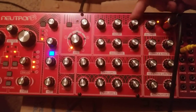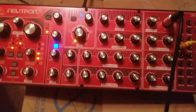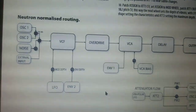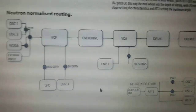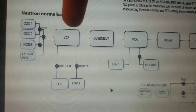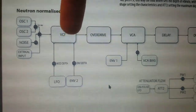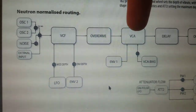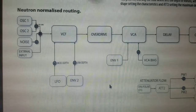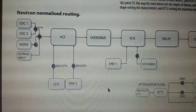The circuit can still add delay, but simply turning the mix knob all the way to the left will remove the delay from the circuit. If we go to the owner's manual here, we see the default routing for the Behringer Neutron — it goes from the oscillators to the VCF to the overdrive to the VCA. What we're doing is coming out of the VCF and going directly into the VCA, bypassing the overdrive, which will effectively remove it from the circuit.